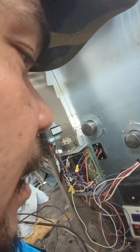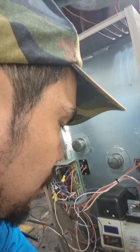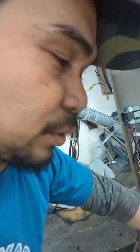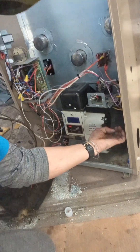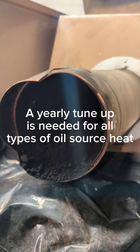There are numbers here for the air adjustment. Look at this — they did not tighten up this thing here. When you don't tighten this up, you get so much air or too little air, and your CO2 is going to go crazy and the carbon monoxide is also going to go crazy. When you do a tune-up, you're supposed to tighten this up so nobody accidentally adjusts it. This is so loose — that's the issue right there. That's why there's so much soot in the pipe.